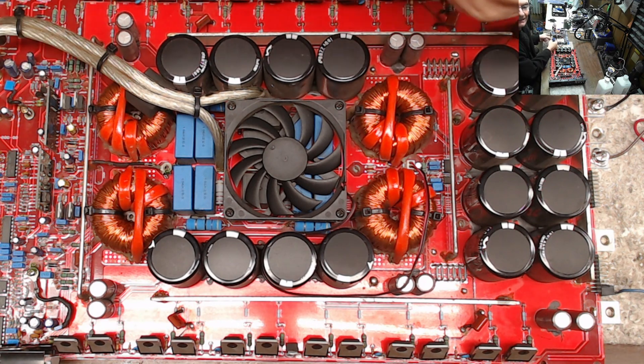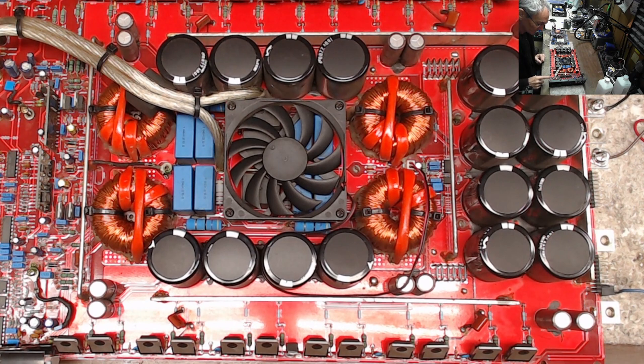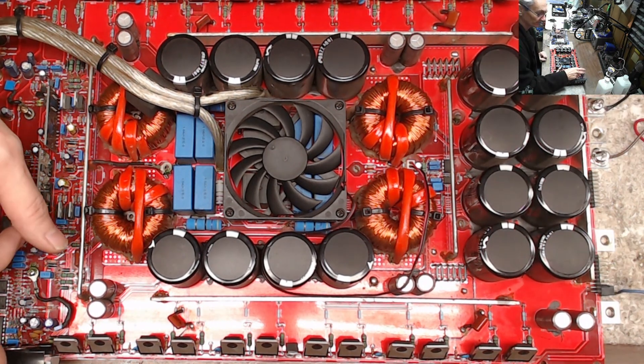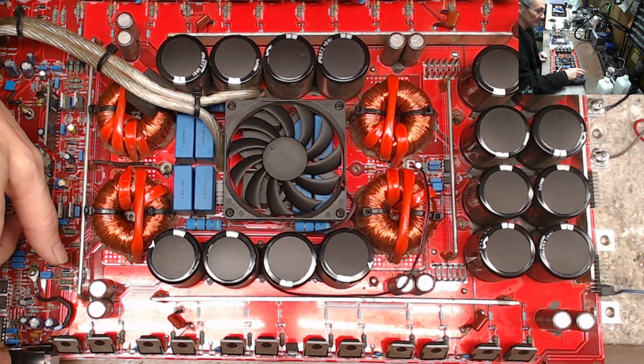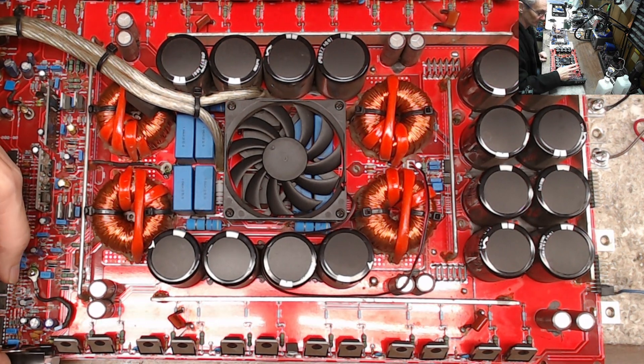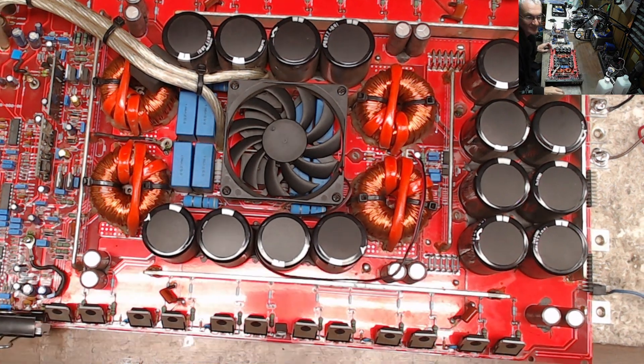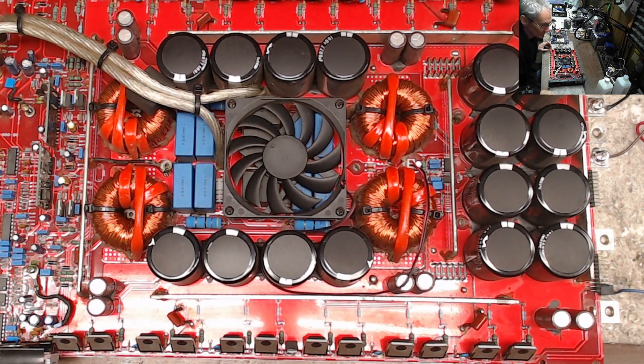This is why I use this external power supply. It produces 58 volts on a positive-negative rail. I also have a lead for AC input for the plus-minus 12 volts for the preamp, and another input that references the additional 12-volt regulators to the negative rail. That feeds the drive for the output section. I have a small heat sink clipped on to keep the regulators from getting too hot, because those regulators do get hot.